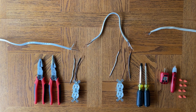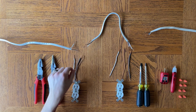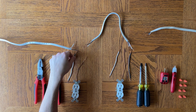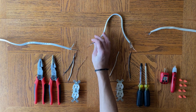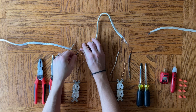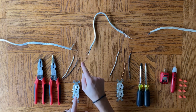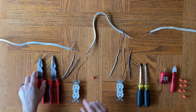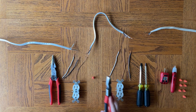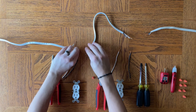So we have our hot line in. From here, what you're going to do is take some jumper wires, connect them to your hot line, and you're going to take this one — the continual hot line — and connect all three together, so these jumpers are going to power this outlet. Connect them up with wire nuts and a good lineman's pliers so you can twist those wires together. We're going to do that right now and wire up all these, then continue on.